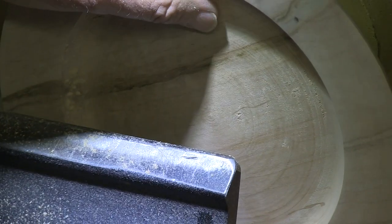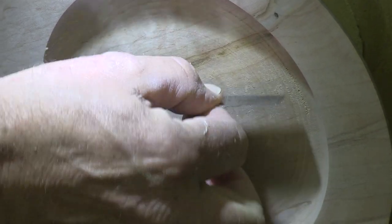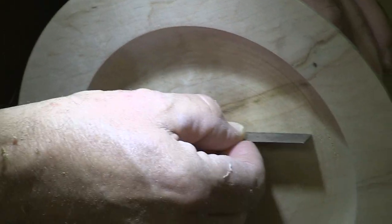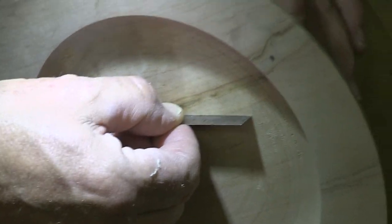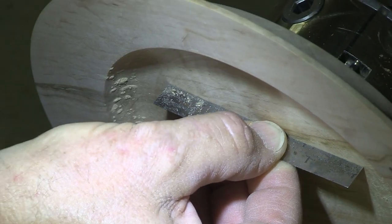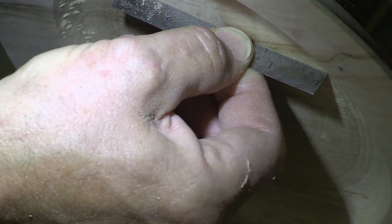And a little bit of. Oh, that's amazingly flat. Take my word for it. It's amazingly flat, except that it's a little dome in the center. You can raise this a little bit off center, and you can see where that dome starts. You're going to see it vertically, but you can translate that to the horizontal, and that's where you can start your flattening cut if you want to make one, because you can see where it stops rotating.